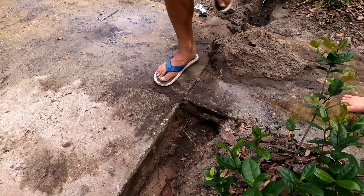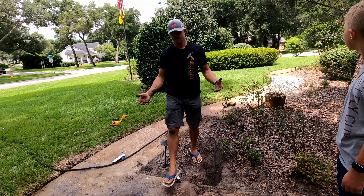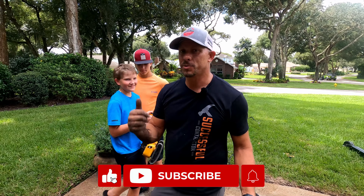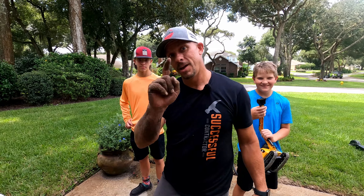It's going to come out somewhere over here — and just like that, we're under the sidewalk! The cool thing about this is I can take this off and reattach this wire puller, which uses quarter-inch quick connectors like on your drill. It's like a Chinese finger trap — you put the wire in, and when you go to pull it out, just like that, and then when we pull this way it pops right off.